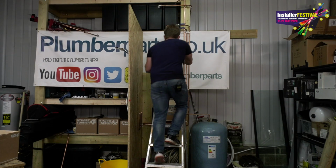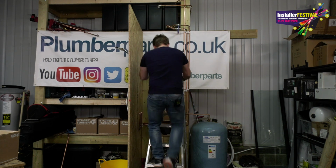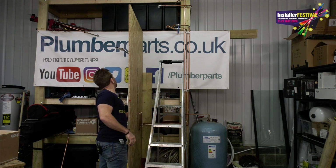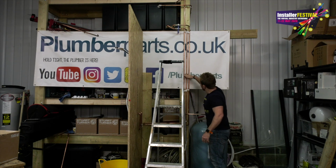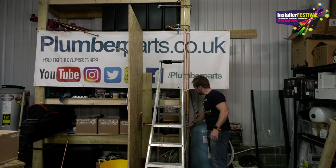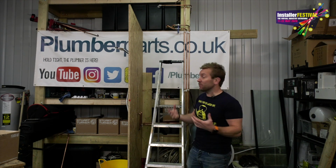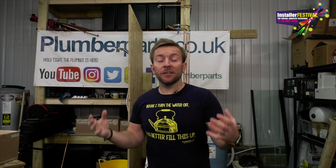Right then, first things first, let's get this water switched off, and also I'll just take a little bit out of the shower just to make sure that's all off now. And what we're doing, we're actually letting the water out of the expansion pipe. This is all slowly coming down till it gets to roughly about here, and then that should stop water coming out then, and we can actually get on with working on this. Because guys, as you all know, soldering, right, when there's water in the pipe, is a nightmare.